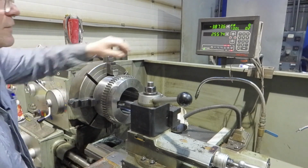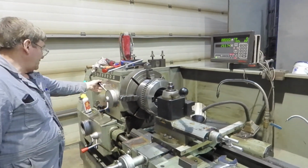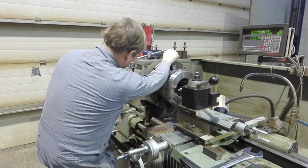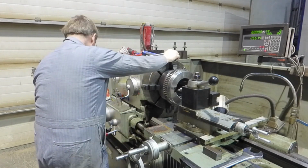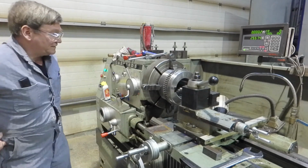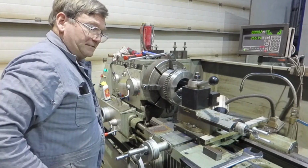This is kind of an interesting question here too, because the way this has been working, when we turn on, we do not want speed anywhere near 1600 or 800. Let's try 280. Done at slow feed. 5 was slower than 3, but 3 is kind of what I usually use on this one. I will touch off before I put oil on it, and then we will put some cutting oil on there.